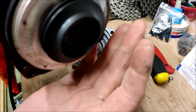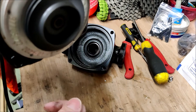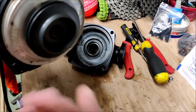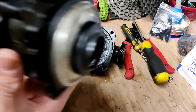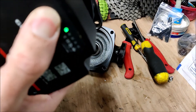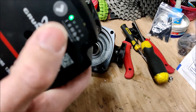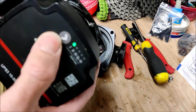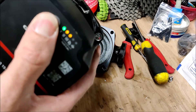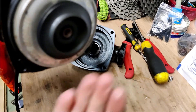It's got a bit of torque there — not that dissimilar to the UPS first series, which I've tried this on as well. But fundamentally it doesn't seem to be spinning any faster than a UPS one, so if it's only spinning at the same RPM it can only shift less water — that's my reckoning anyway. This is on the max power setting. It's a quite smart pump: you can have constant speed, constant pressure, intelligent mode and so on, but I just need it to pump as much water as possible to keep the boiler happy.